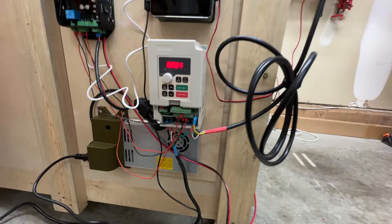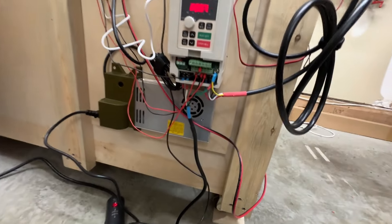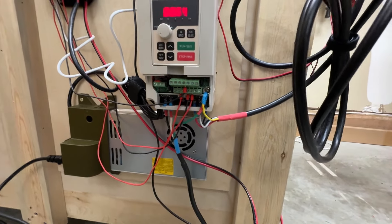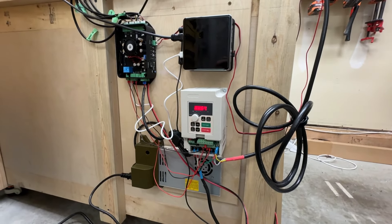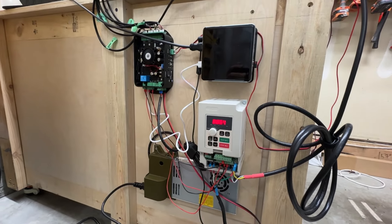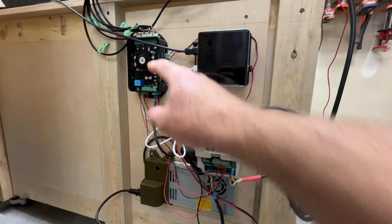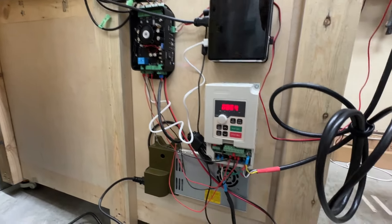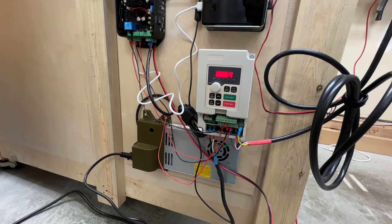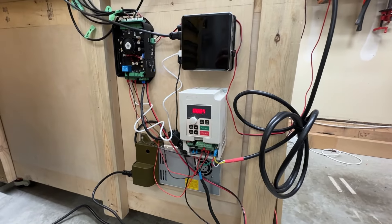The spindle cable is running shielded wire — I probably need to add some strain relief so it's not hanging. It's all wired down to power running into the power bar. On this spindle I'm using the 0-to-10-volt output on the xPro V5 controller to control it, and the relay on the xPro V5 to turn it on. Essentially when the relay is tripped using the M3 command, the VFD goes to run mode and takes the 0-to-10-volt input to control speed.